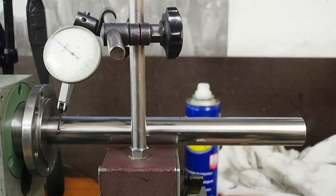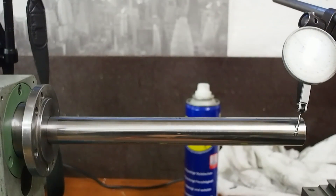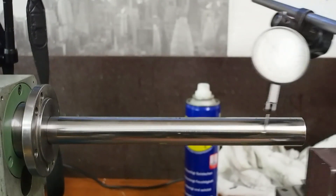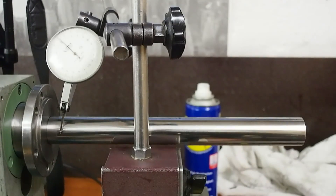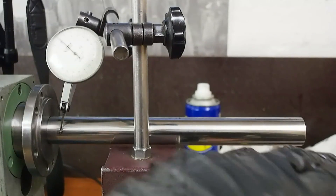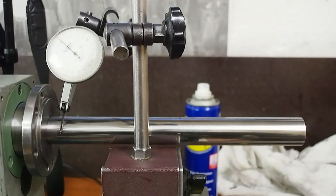In the horizontal I still have a little more work to do, because we're still pointing forward about seven ten-thousandths with a limit of two. It's getting quite difficult to do the scraping — trying to balance vertical alignment, horizontal alignment, and also scraping for points to try and broaden out the contact areas which clamp against the bed. It becomes quite difficult as you get close.